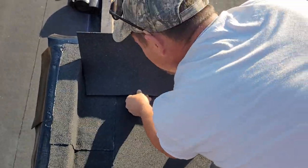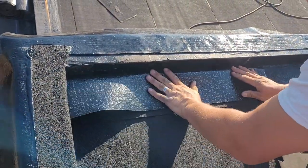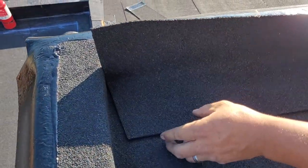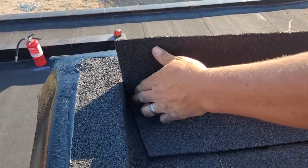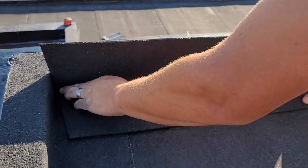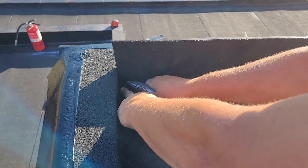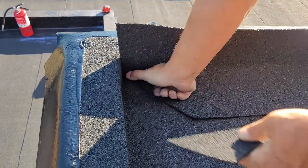Get it on my line, dry fit. It was a little too exaggerated so I'll pull it back just a smidgen — see how tight that gets? Beautiful. I'm going to cut my bottom edge at a 45 degrees. At the top of the roof we like to have our corners look like a beautiful bevel. I don't want to screw this corner up so I gotta be really careful with how much heat I throw over there — still want a full seal.